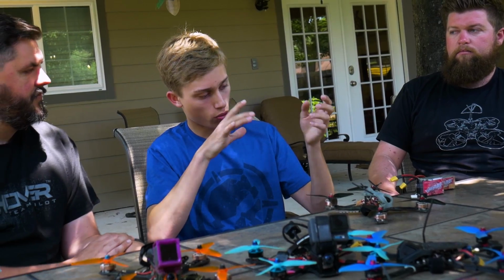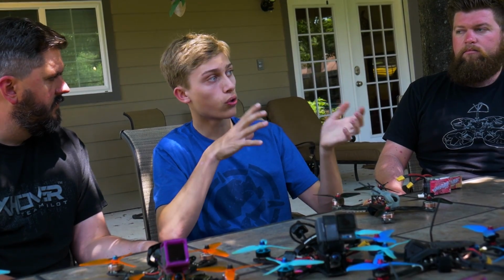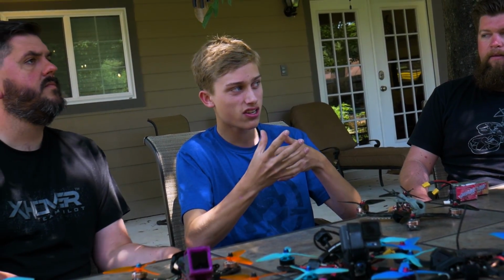But at the same time, we also are moving into courses now, no matter what the voltage is, where you're trying to get efficiency, and so we're actually down pitching our props. So for us, it's almost the opposite. If you're outdoors with a freestyle quad, we have a really big long track. We're going to run a really light pitch prop because we're going to be at full throttle the entire time. And we want the efficiency. Whereas if we're on a more tight technical track, we don't worry as much about the efficiency. We want more control, which a lighter pitch prop doesn't really give us on a tight track.